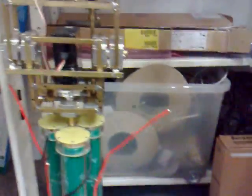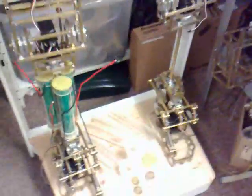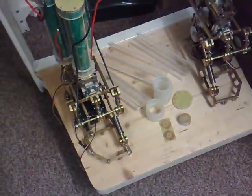So what I'm going to do is have two battery packs — one on this side, one on that side — diode couple them together. Each one of these is 13 amp hour, so I'll have 26 amp hours to play with in total at about 7 odd volts. So that should be enough to power this for quite some time really.